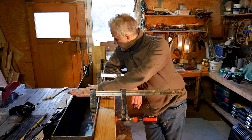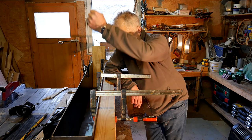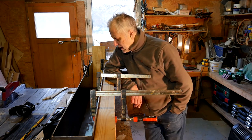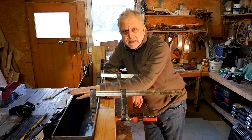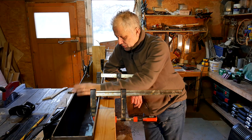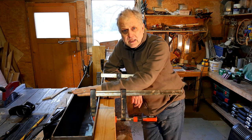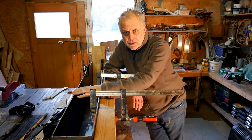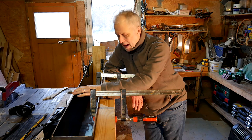So it'll be filled up with lead, it'll give us the 1.3 tons of ballast that we need, I say with the bolts protruding out, to fix it on through the floors of the boat. The steel box itself will remain, and will be treated as though it were a steel boat. We'll put a couple of zinc anodes on the outside. She'll be epoxy sealed completely on the outside, treated exactly as though it were a steel boat. It should give it a good lifespan.